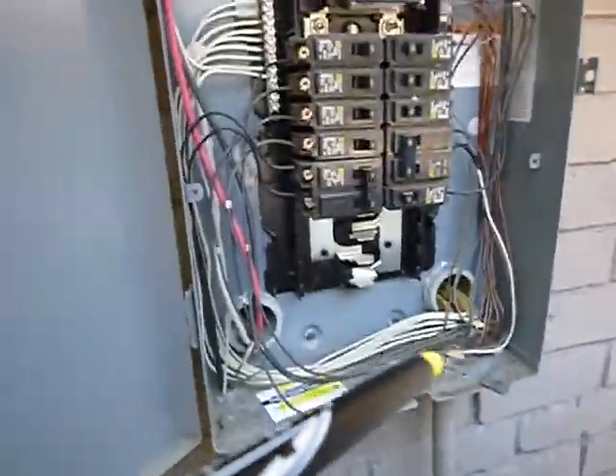The sub-panel is not properly labeled — that's handwriting, not printing. They don't have duplication, not enough information, and it should be sealed on three sides.